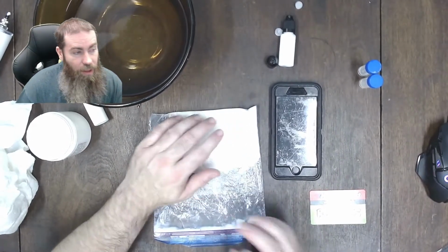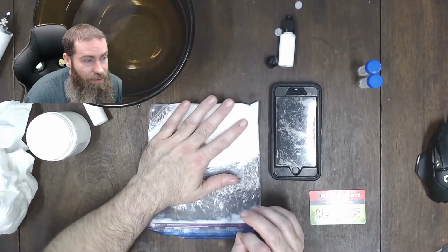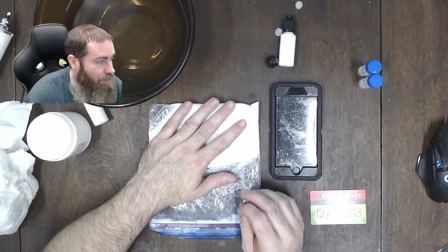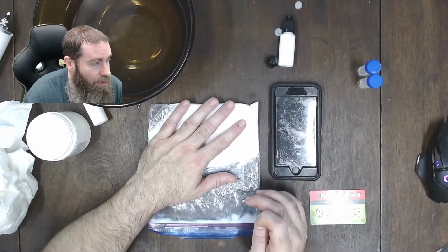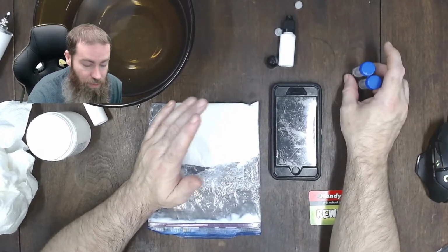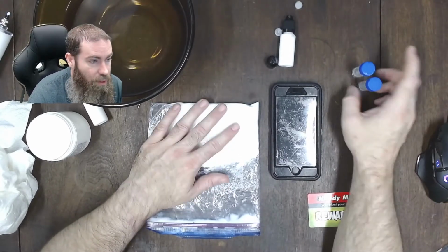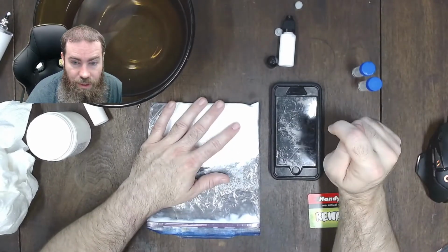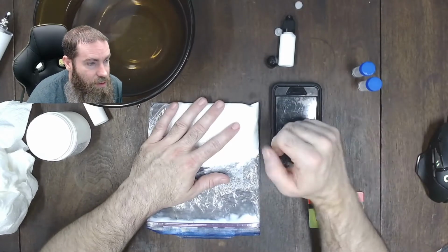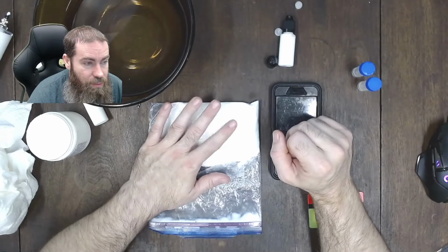Also, just going to say it again, make sure you use the correct thinning oil for the type of lube you are using. If you're using a PAO oil, you definitely want to use a PAO grease. You're definitely going to want to use a PAO based oil. And I'll post down in the description some of the lubes and their compatible oils to the best of my knowledge.